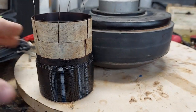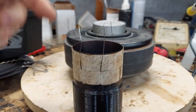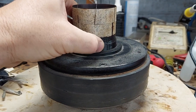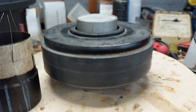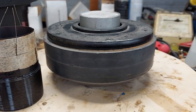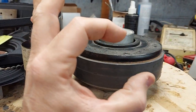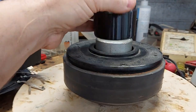Once you've marked it, when you find the shim to hold it in place, you come down and see the mark, and you want to make the mark level with the top of the top plate — that centers it. Then you use the shims to center it concentrically. You want to be right in the center — not off left or right or anything like that. You want dead center.